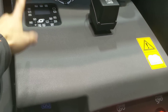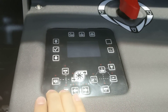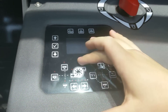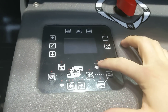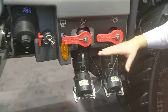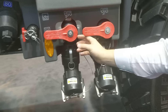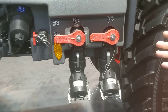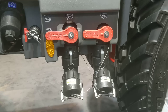What do we have up here for a keypad? This is our control panel for the whole sprayer. We've got the suction side here and the pressure side here. The liquid always comes from this area, goes through the pump into the pressure area — through the boom, back into the tank, into the cleaning system, or overloading to another tank. You can suck in your water from this side and overload it on the other side — basically you can also use this as a big stationary pump.